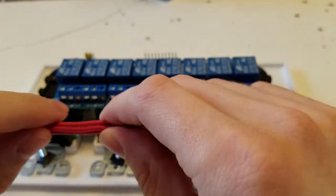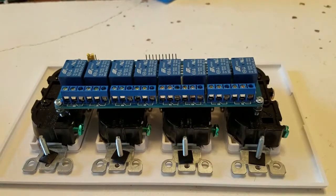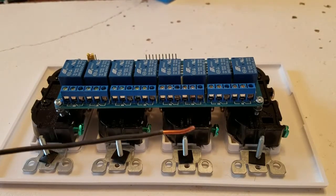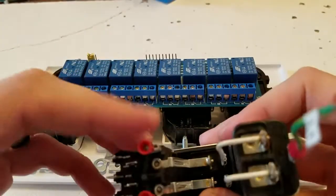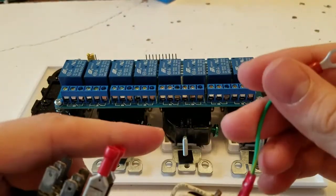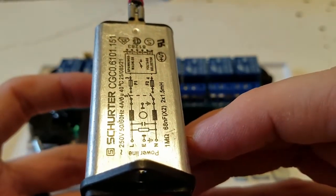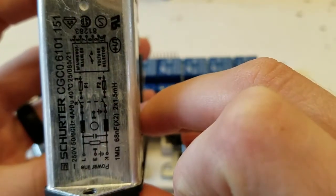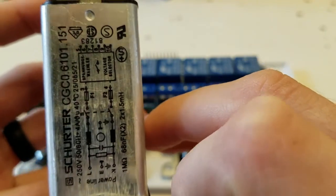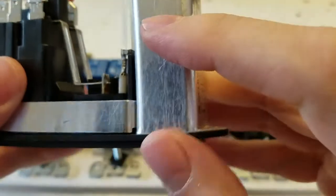And then from there, we're going to end up pigtailing them, or wire connecting them all together, and eventually they'll go to a single wire, which will be the lead, which will go onto this, which will crimp on to this one. So we've got our ground, we've got our live, and our common. Or neutral, whatever. Can you read that? So yeah. All right, so I'll start doing that, and we'll go from there.